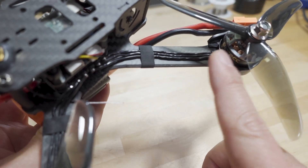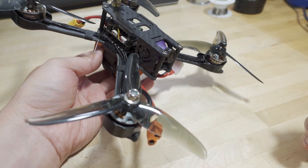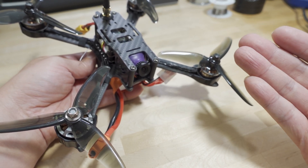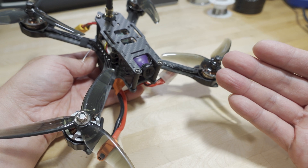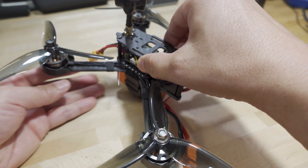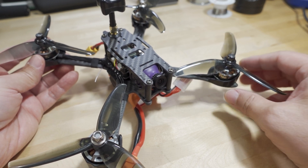You can see these CCE-style motors have pretty thin motor wire. If you don't like this frame but you like the parts, you can always transfer them to another build - that's what I did with the $88 quad. I also did a video converting that one to DJI. Obviously these are budget parts for under a hundred bucks, and you should expect performance appropriate to that price range. If you're expecting to spend a hundred dollars and beat everyone at your next local FPV race against $300 racers, that's probably not realistic.